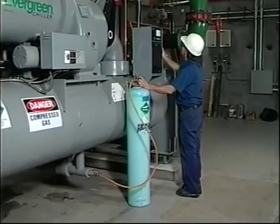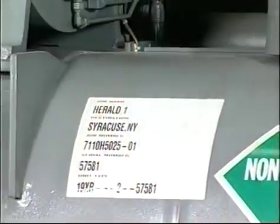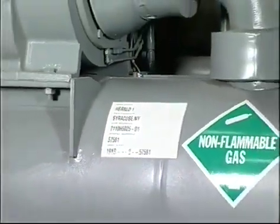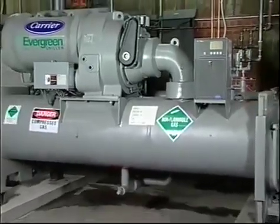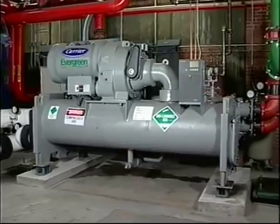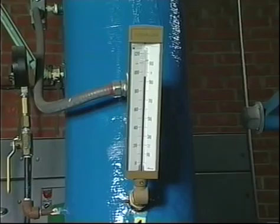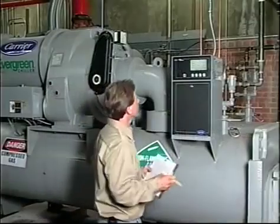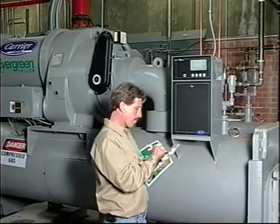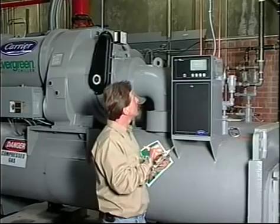Remember that if the critical balances of refrigerant, water, oil, and air are maintained, improved efficiency and cost savings will be realized. These result from lower power requirements and the prevention of unexpected major failures. Basically, the aim is to keep the condenser head pressure requirements within equipment specifications. This will result in the lowest possible kilowatt requirements. To achieve this goal, equipment must be continually monitored so that the owner and operator are aware of existing conditions and can take prompt remedial action.